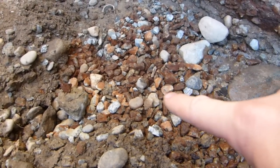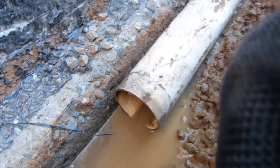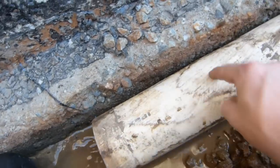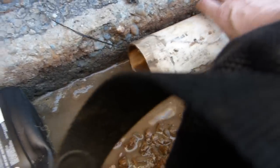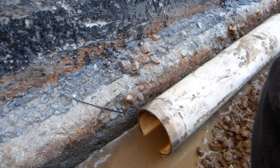All of this drain rock should be underneath and around, surrounding and blanketing the whole drain pipe. The drain pipe is perforated on the underside — not this one, because I just grabbed a length — but the actual drain pipe is perforated on the underside, so the perforations should be facing down. The whole perimeter drain should be enclosed with ¾ inch crushed gravel.